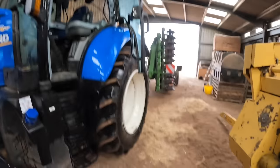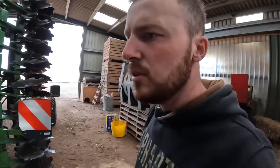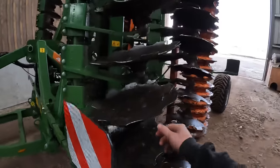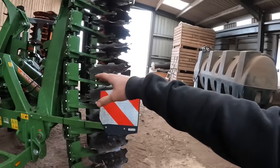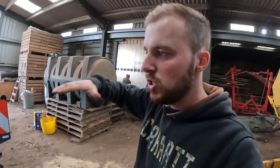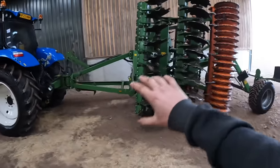Back up the yard because it's raining quite heavily - didn't plan on talking like this! We've got the irrigator running for the last time, just giving the potatoes a drink. Having a look around these big discs - I think they're bigger than what we've got on the Lemken drill. What I like about these is they're sprung with rubbers. If one disc is in a tram line it'll ride up while the others stay down - it contours the ground so you always have the disc at the correct depth in any circumstance.